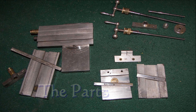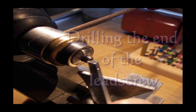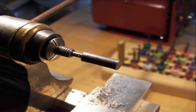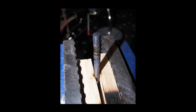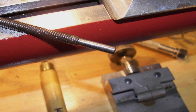First thing I did was break down the cross slide, clean everything up. There's the Z axis lead screw that needed to be extended — I had to get the handle off the end. I mounted it in my old Moseley lathe and used a graver to put a little dip in the front so I could hand-hold a drill bit to drill out a hole. I made a little extension piece out of cold rolled steel, flattened the sides of the part going in, so that I could braze it — and brazed it in position. It was a little sloppy with the brazing, but it was plenty oversize, so I just took it back to the Moseley and cleaned it up, trimmed it to size. You can see it's cleaned up quite nicely — I'm really happy with the results, it fit in there quite nice.